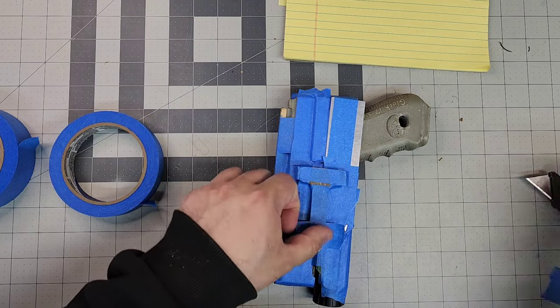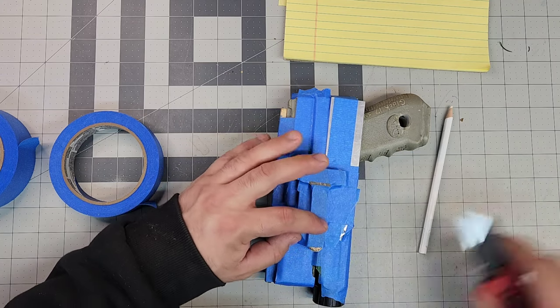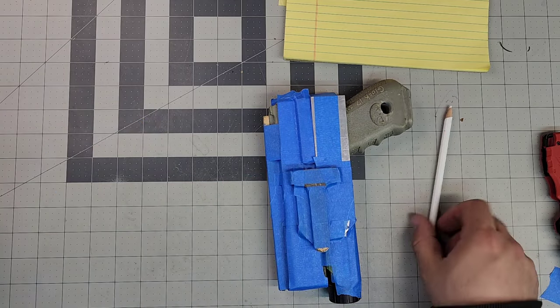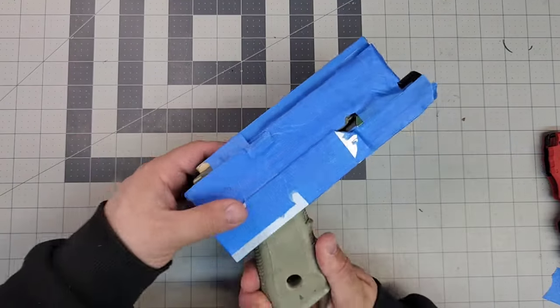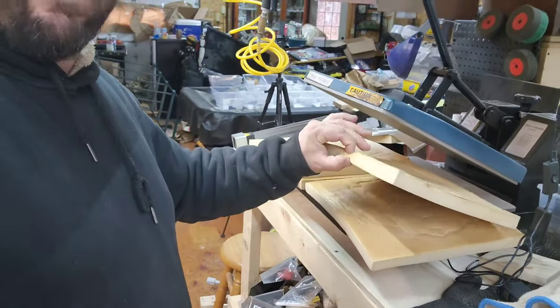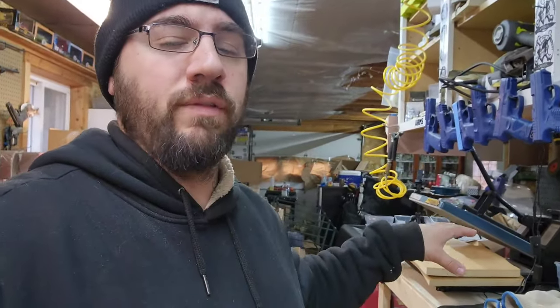There we are right there. Next, all you gotta do is make a retention plate out of quarter-inch MDF and then we are ready for the press. You can hear the clicking in the background — the presses are on and the foam is nice and hot. I can almost touch my fingers through the foam, which is exactly what you want. The more uniform the heat on the foam itself, the better you're going to squish and the better outcome you'll have. These have been in here for probably 25 to 30 minutes and they're all up to temp. I'm going to cut the MDF, cut the piece of FDE kydex, and throw it in the press.